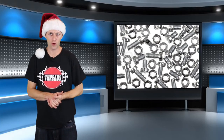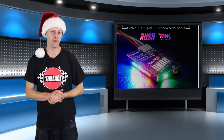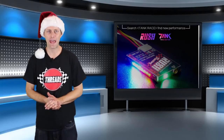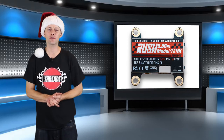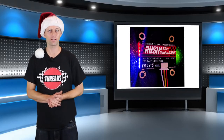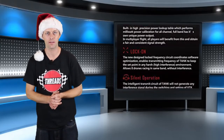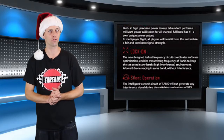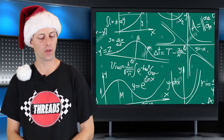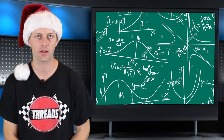Let's get away from pre-assembled drones and get into some of the parts. New from Rush FPV, they've come out with a new VTX called the Tank. This thing supposedly has VTX lock-on, so eight quads can fly simultaneously on the same band without using left-right polarity antennas and have no crossover bleed from another channel. I had to dig a little deeper to see what Rush Tank is doing that makes their VTX so much better.